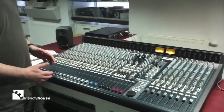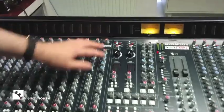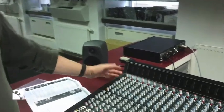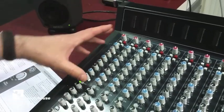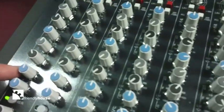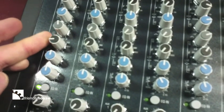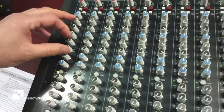It's 24 mono channels plus two stereo channels, and the stereo channels have a choice of two inputs, so we have a lot of sources available. The immediate thing you'll notice is we have a long EQ section — this is probably the best EQ Allen Heath has ever done, the most expensive EQ and pre combination. This is fully parametric mids. The EQ will sweep down to 18 hertz, so you can do peaking and dipping EQ with very low end — it's like a recording EQ. You have an LF shelving control, HF shelving, plus two parametric sections.